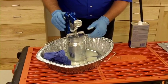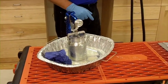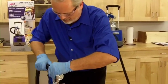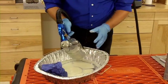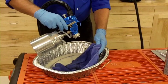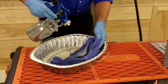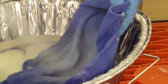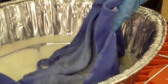I'll let that soak for just a minute. I'm gonna get my air hose from the 5500 and connect it so that I can spray that mineral spirits through the gun — I'm just going to spray this right down into my tray. The trick here is I use my rag to spray into so I don't squirt the mineral spirits up into my face. You can see it comes out the color of the paint that was in it at first, but almost immediately it turns almost clear.